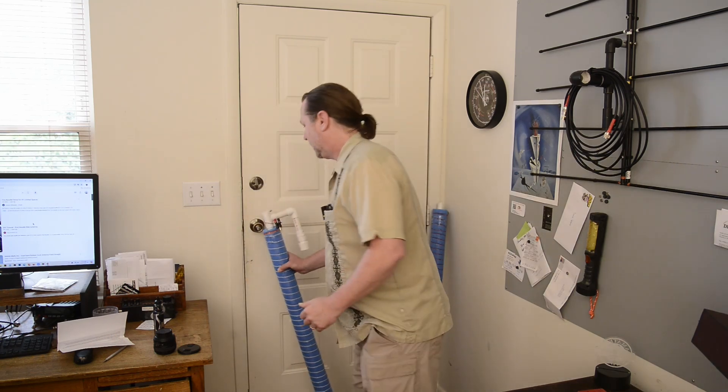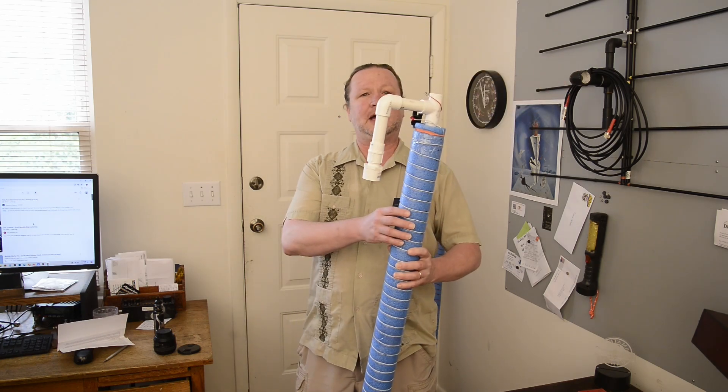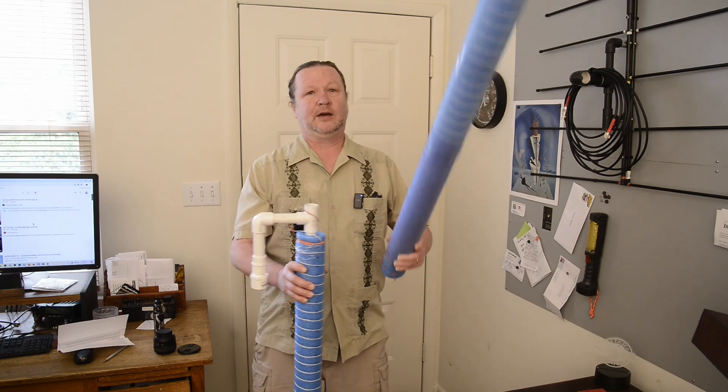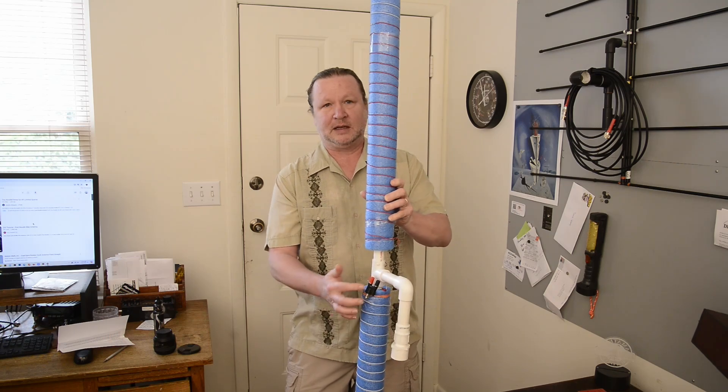I did put together an antenna that I was wanting to make for a while now. I saw this YouTube video from K7RAW, and he was making antennas from pool noodles — and I have them right behind me. Basically, they're made out of pool noodles, and then we run some PVC pipe, take some wire, wrap it around, and I made mine so it can be broken down into two pieces. These two pieces slide together, and then I just have a BNC.